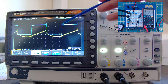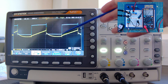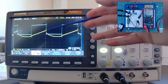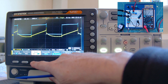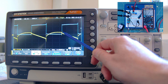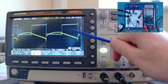You can see the output is in sync with the switching of the floating capacitor flipping backwards and forwards. At first it looks like the high part is charging and the low part is discharging, but remember this is minus 5 volts — it's a negative charge. So actually the downward swing is the charge cycle and the upward swing is the discharge. Let me invert the trace — there we go, now it's more representative: charging up to minus 5 volts and then discharging.